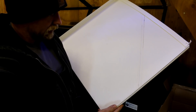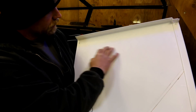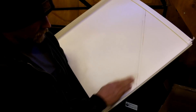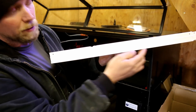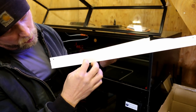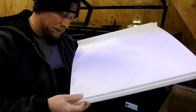Look over here — everything looks really really good, this is how it's supposed to turn out. But over here we have separation. In addition to that, see all those wiggly lines? Everything was nice and straight and then we get these wiggles, and that is because too much material is coming out. I think that is probably a leveling issue.